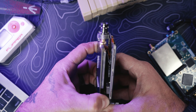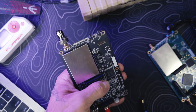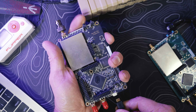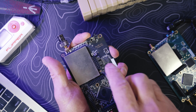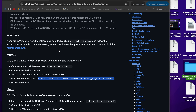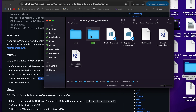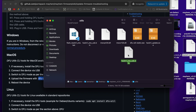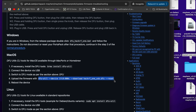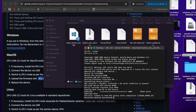Quick recap: tear the two boards apart, get your HackRF One board, hold DFU button, plug it in, green light on, release. Download Mayhem 2.0.1, unpackage it, go to the utils folder, take the hackrf1_usb_dfu file, put it on your desktop. In terminal cd to Desktop, paste the command, run it — and you've upgraded from 1.4.0 to 2.0.1. This works on Linux as well.